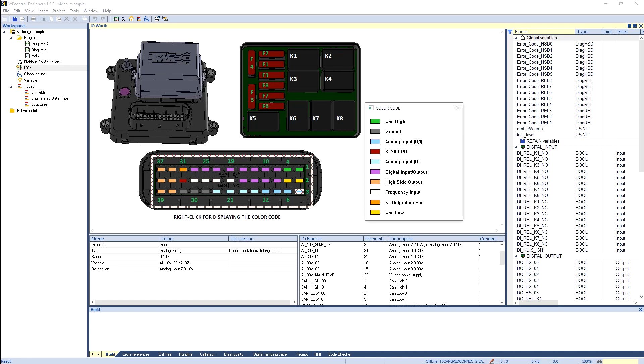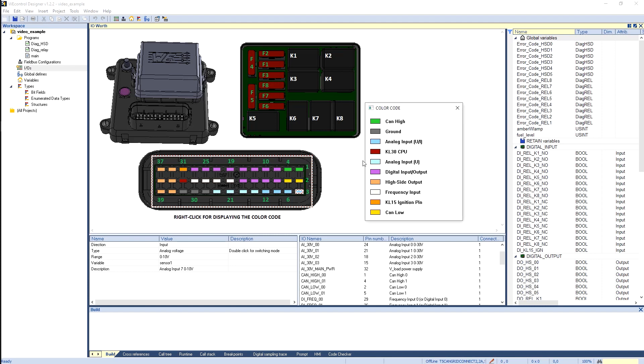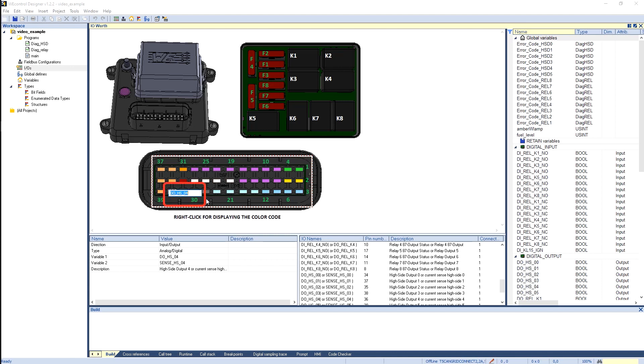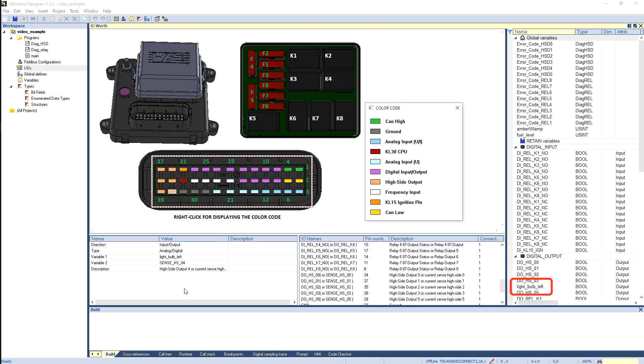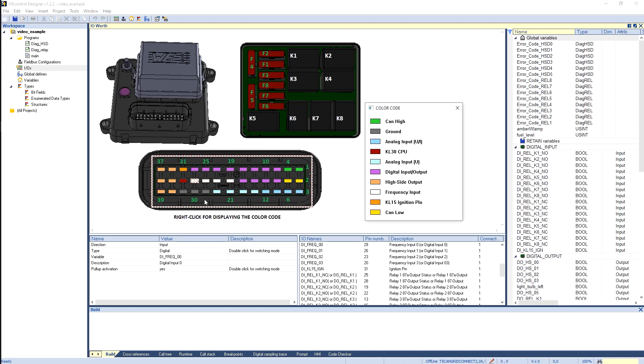Simply select the pin you want and you will get all the needed parameters on the screen below. For example, this pin is a 0–10V or 0–20mA analog input. If you double-click on the pin itself, you will have the possibility to change the input variable name, which can be used in your code. You will see pins with more than one variable in the configuration. This means that we have attached several functions to those pins, like a digital output and an analog input for current reading. The first variable name can be changed directly from the pin and the new name is then directly taken over in the variable overview. The other functions attached to this pin must be changed in the table.